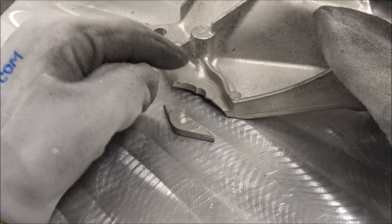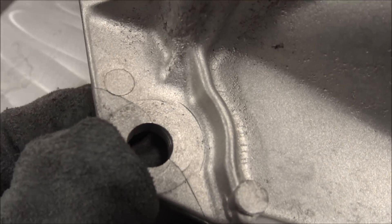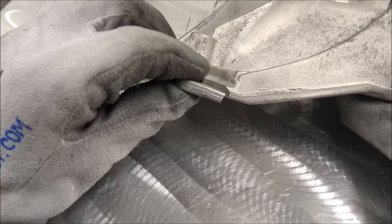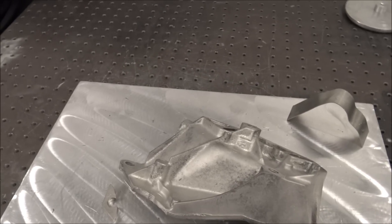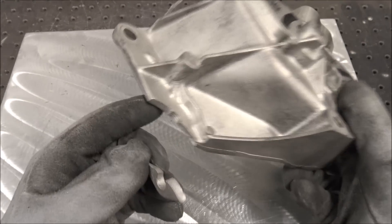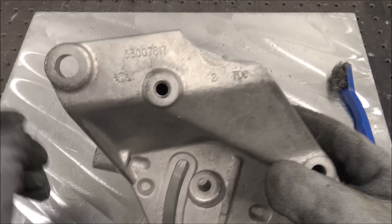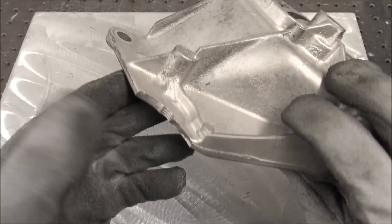Today I'm going to try to repair this for a friend of a friend. It's a really clean break, which is kind of rare with cast, and he sent it to me nice and clean — I'm very grateful, hardly anybody cleans parts this good. What could have happened is maybe it's just a bad design, it looks like it's way too thin, or maybe they were taking it off the engine and this bolt hole was overlooked and they were prying on it and it cracked. It's quite common on cast parts — you can't really tell the quality, whether it's aluminum or more pot metal. So I'm going to do a little test weld somewhere in an inconspicuous area to see how strong it is before I spend the time trying to fix the part.